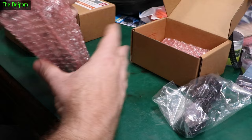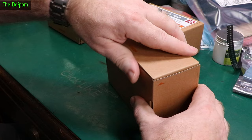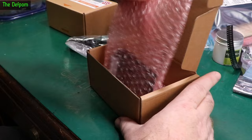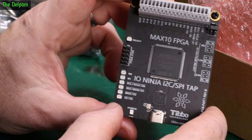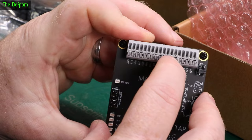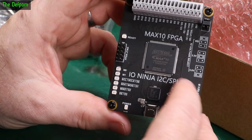There's a USB-A to C cable included. This is Tibo Technology and it's called IO Ninja. They have software that works on Mac - I think it does Linux as well, and obviously Windows. This one's the I2C and SPI tap. There's voltage selection - it's set for 3.3 volts right now, but you can choose 5 volt as well. So you've got variable voltages. Obviously USB-C, and it's got some indicators. There's also an FPGA JTAG port for programming the FPGA. It's also got quick connect ports along the top, which are really nice - you basically push the wire in and then just push down and release. That's the I2C and SPI tap, which is probably the main thing I'd use most likely.